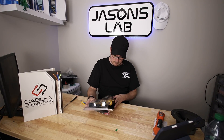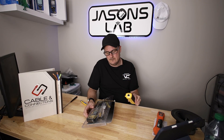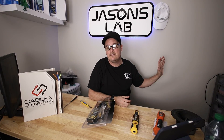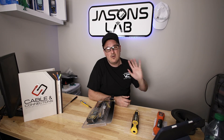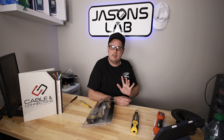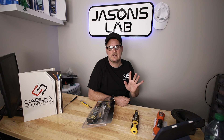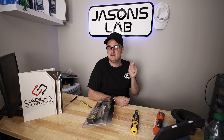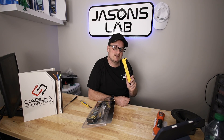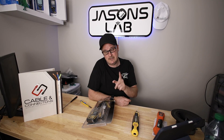Now for the main part of this video — the digital toner from Cable Connections. My favorite Trend Networks analog toner works very well, but the problem is when toning wires near electrical, you hear a lot of AC noise and you won't hear your tone. When you use a digital version, it filters all that out and you only hear the digital signal. Very very handy.